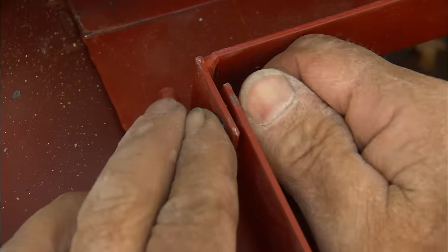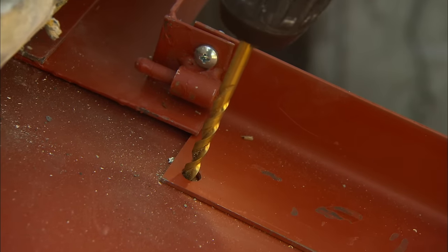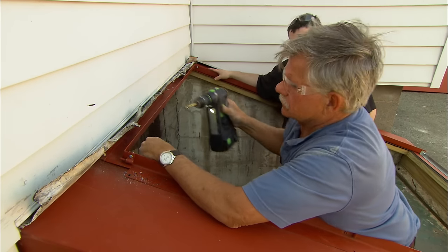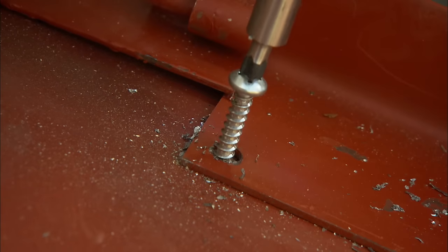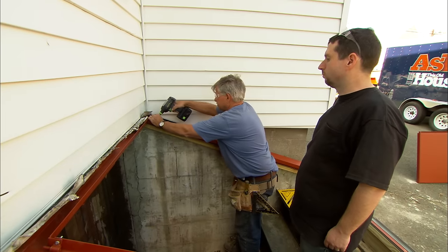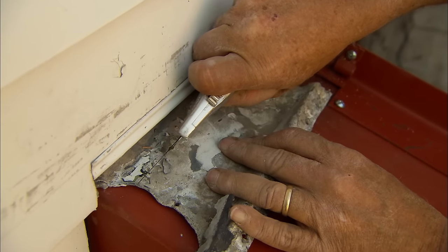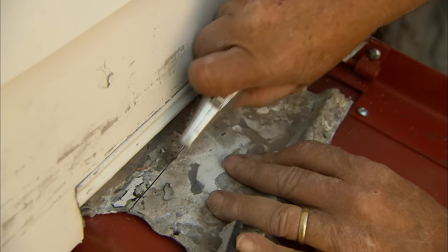You just want to hand tighten these nuts and bolts. Next I want to drill a hole right through the steel right there. Now I'm going to put a screw in there and hold it into position. Now we're actually going to use the old flashing right here. It looks like it's in pretty tough shape, but we actually have a nice thick bead of caulking in behind it.